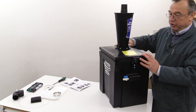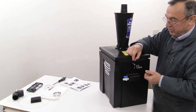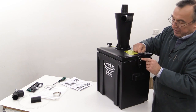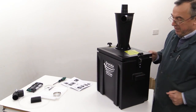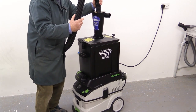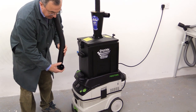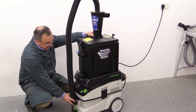The next step in the instructions is to put the lid in position and do up these straps. There's a hole at the top where we're going to get this little lug to fit through — like so — and the same on the other side. With that grounding strap trapped in between, it's making the electrical continuity between the top and the base. Next is to attach the hose which goes from the top of the Dust Deputy to the front of the extractor. For the lower fitting on a Festool extractor, this right-angle gadget is perfect — it goes on simply like that and then pushes into the extractor.